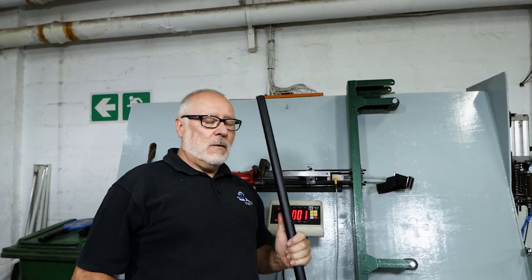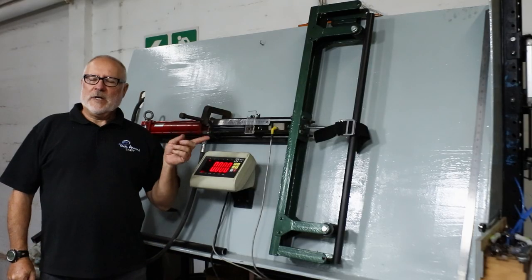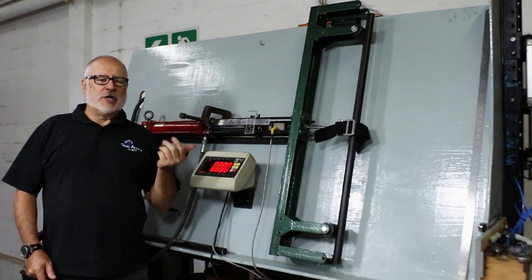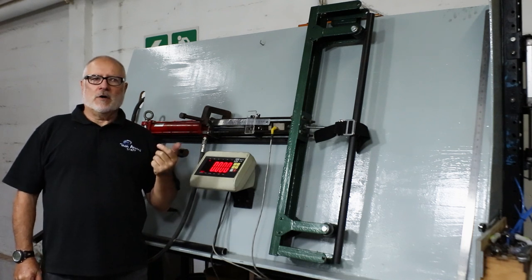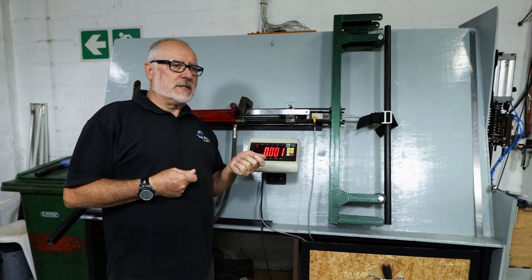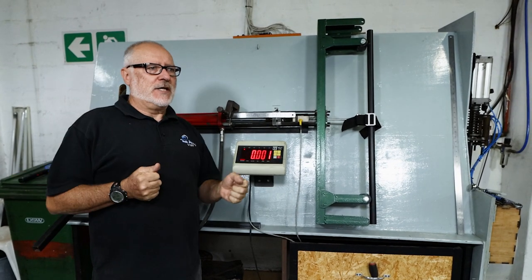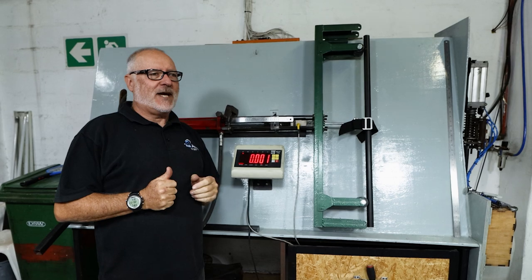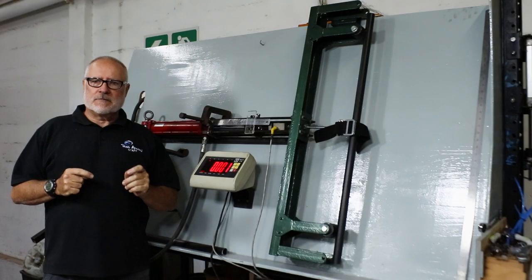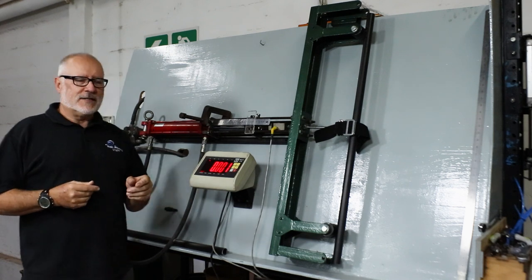We're now going to do an aluminium tube, which is a standard general purpose type of aluminium, not aircraft grade, and it doesn't have a rail, but it's the same diameter, same wall thickness. What we're going to demonstrate here is the difference between general purpose aluminium as opposed to aircraft grade. Aircraft grade is actually very similar to general purpose, but it has been treated and hardened by work hardening it through special dies and tensioning it and heat treatments. I'm not exactly sure on the science behind it, but it does make a significant difference to the break strain or tensile strength and/or flexibility. Let's see how it does.